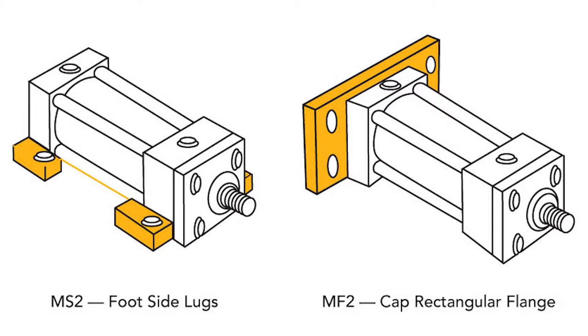What about lug mounting? These are some of the more rigid cylinder designs. That's correct. Lug mounting uses rectangular tabs machined from the same block of steel as the head and cap, although they are sometimes welded on. The four MS2 side lugs are on the bottom of the head and cap, the MS3 center lugs are midway up the head and cap, and the MS7 end lugs are mounted to the front bottom of the head and the back bottom of the cap. They are indeed very rigid, but their dual mounting points can add worries of misalignment between the front and rear lugs, especially related to bending or torquing of the mounting surface.